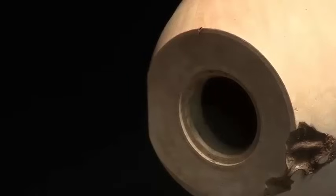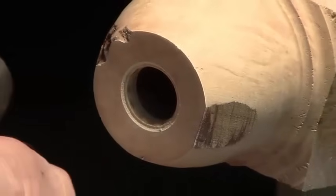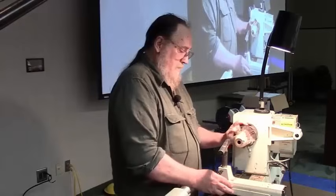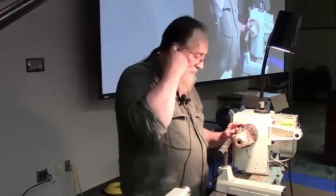This is the next to last sanding I'm going to do. I will sand parts that I can't get at later. I usually sand hardwoods and exotics to 400, and natives like cherry, walnut, oak to 220. Rarely sand more than that. Now we're going to start cutting on the outside. We have this chamber on the inside and it's against the rules to go through — we did talk about you can't make the inside bigger than the outside. Well, there's a corollary: you can't make the outside smaller than the inside.